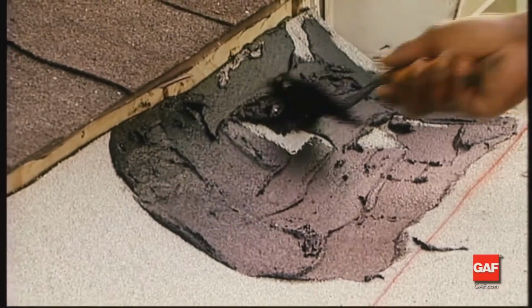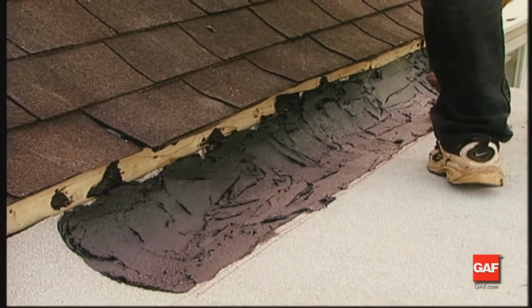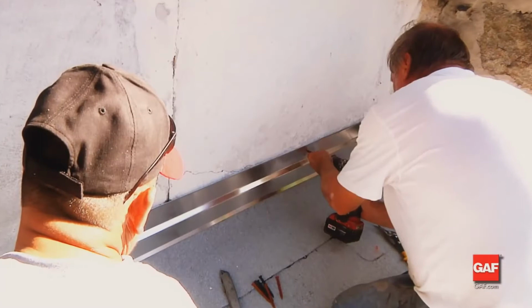Flashing of walls, roof terminations, and penetrations can also be done with Liberty membranes and pre-flashed SBS M-Weld units. As with all vertical flashings, the flashing is nailed off at the top and counterflashed.